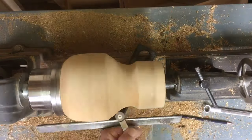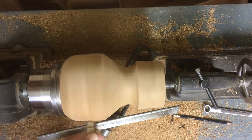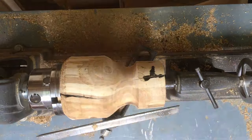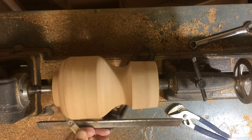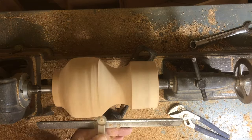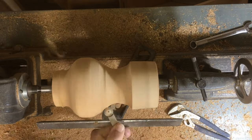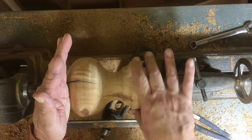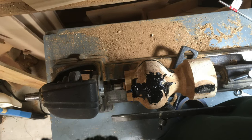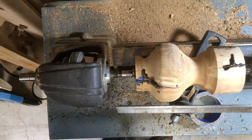I fit it to my chuck, turned it around, and started putting some epoxy in the cracks because it was fairly well cracked up. I started with two-part epoxy, went to some black CA glue in the smaller cracks and crevices, went back to the epoxy a second time, went back to the CA glue a second time — slowly but surely filling in these big voids. I kind of like the looks of the black in the cracks, so I'm slathering more of that on, giving it some time to dry, and then turning it down.